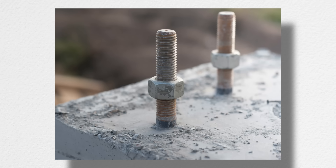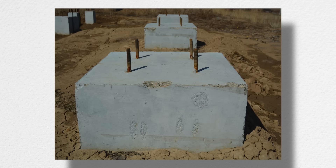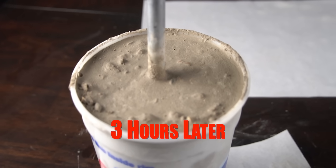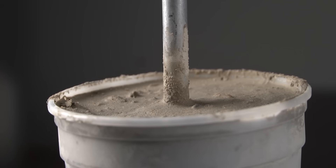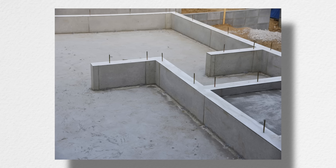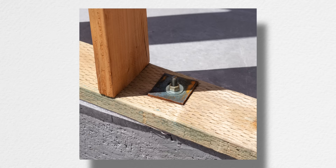The other reason why I don't utilize these is because of constructability. These are cast-in anchor rods, which means they have to be installed into the concrete before the concrete hardens. So you need to move quickly, making sure that the anchor is deep enough, spaced at the correct spacing required, and that the anchors are straight and plumb so you can thread your sill plate through the anchor rod and then fasten it together. Ask anyone who does this for a living — it's difficult.